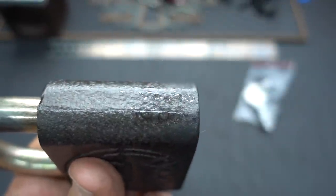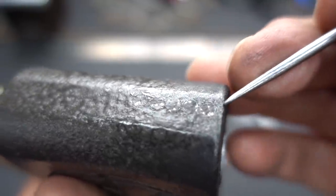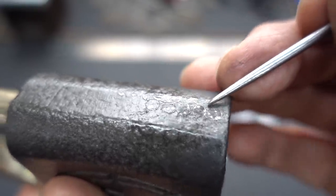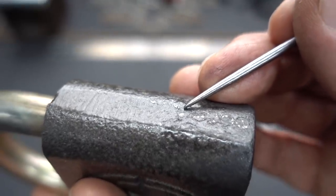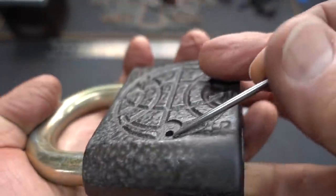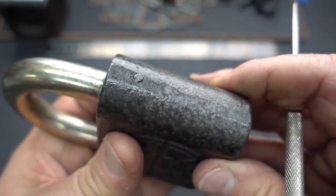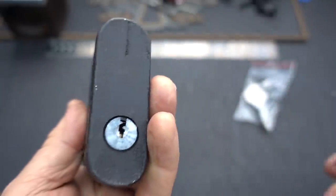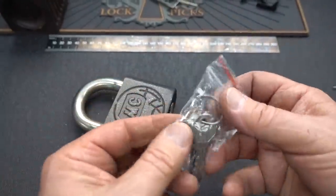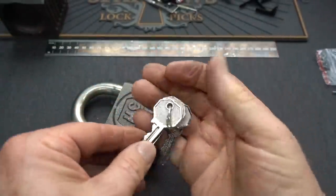Let's see if I can get it through the camera lens. You can see where they pinned it through the side of the lock and then painted over it, but you can still see it — one, two, three, four, five pins. This may be a four-pinner, and the fifth one might be the brass rod that retains the core. I think it's probably a five-pinner because on the front here we have a little pin that lines up with the core, so that's probably the core retention pin — it does not go all the way through. Over here we have another pin that holds the shackle in place. We have an aluminum core, which is not unusual on Russian locks. I do have a bag of keys, so let's take a look — and looking through the bag, it does look like a five-pinner.